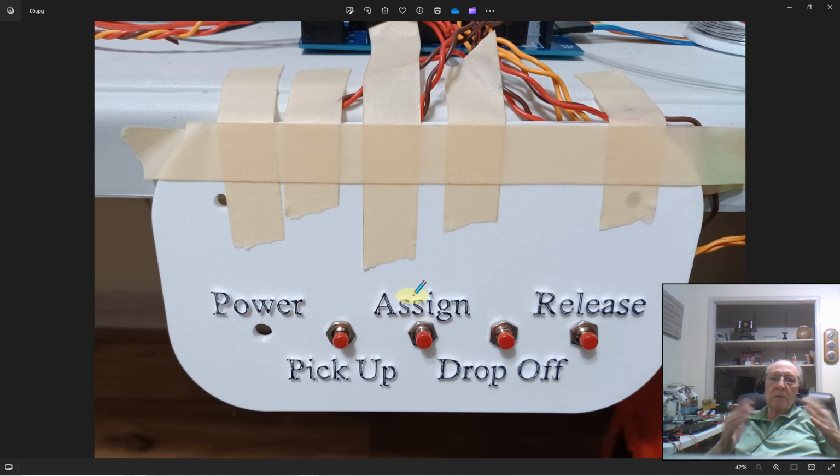So now there's a relationship formed between this reader's location and the engine that's sitting at it. But the first time out of the box, this is unique. First time out of the box, when you roll an engine up on here and push assign, that nano is going to tell the server, hey, check if this is an engine and it's valid to use. Well, guess what? That engine is not in the database. So now you've got a Catch-22.